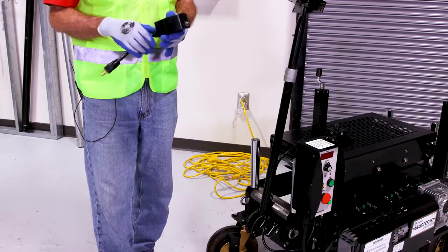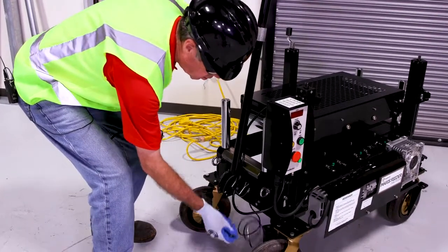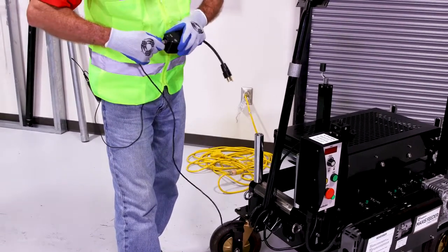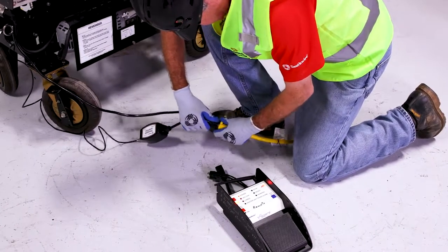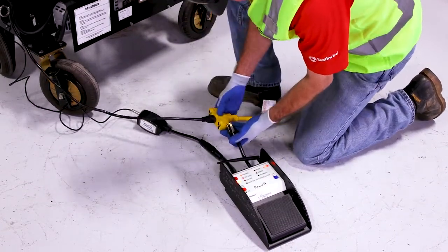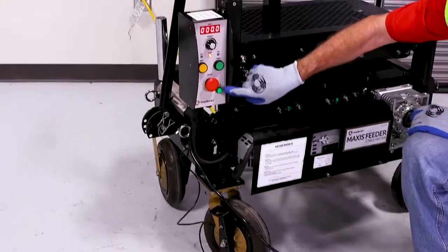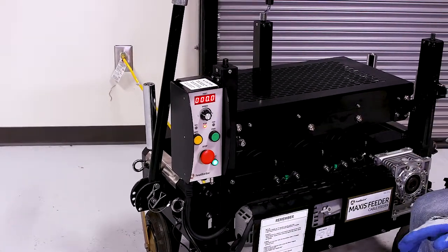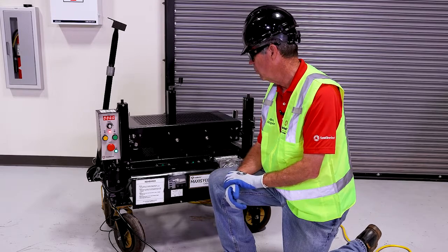When we're going to use the feeder in conjunction with our triggers, you're going to need to get an adapter. We have a cord here for the adapter. What I'm going to do is take my adapter and attach it to my trigger, because it is now a dead man switch. We have what we call the trigger option button — when engaged, this will only operate when the triggers are in use.